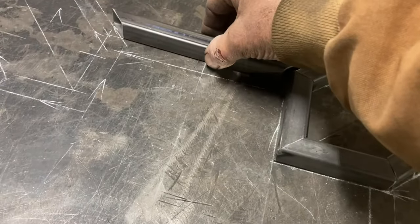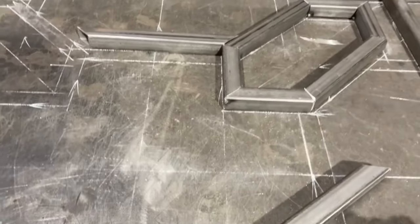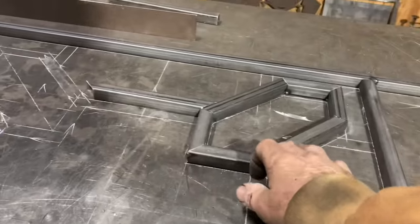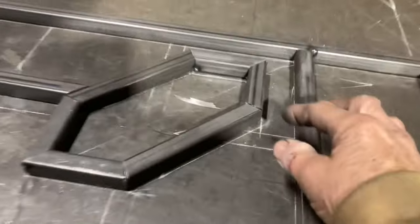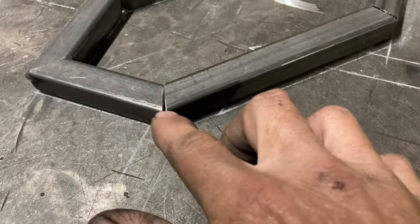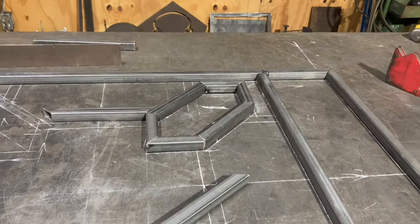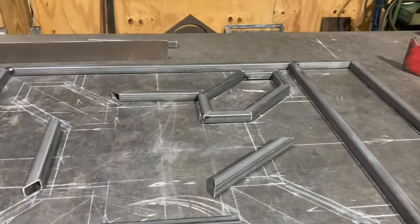We'll come back and fit that in — it goes right there somewhere. The drawing is kind of off a little bit, so we're just going to make do with it as it goes. I think as long as I do all these first, that'll work out hopefully. I see I got my miters off a little bit already — I cut those at like 21 degrees or something. I thought I was right; I knew it was 22.5 and I still went against it. But anyway, it won't be hard to fill that up, so we're going to get to cleaning them up and try to put some of those together.